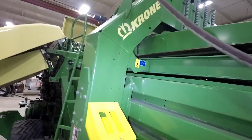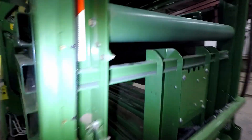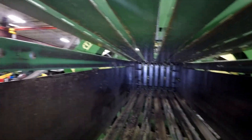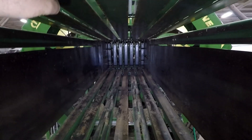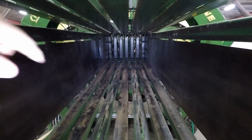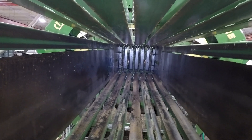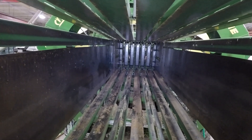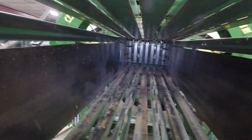So our whole chute — they're going to move that entire side. As we need more pressure, this entire side plate and this top is going to push down onto this bottom, just to try to cause enough tension for that bale. So it will have to go through there and we can get a denser, tighter bale all the time.